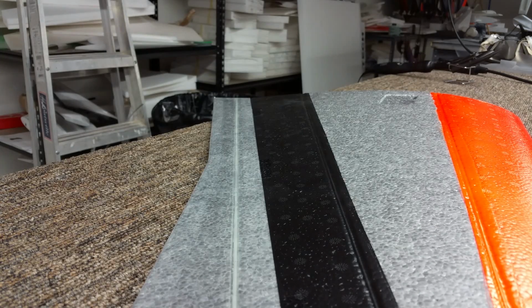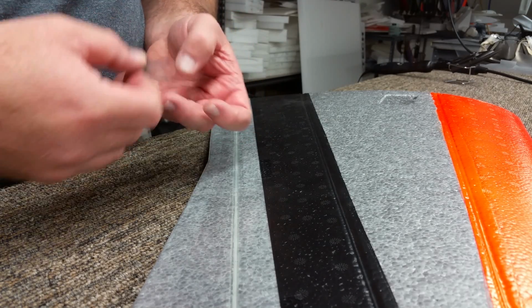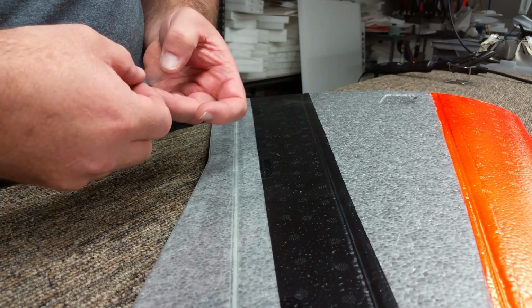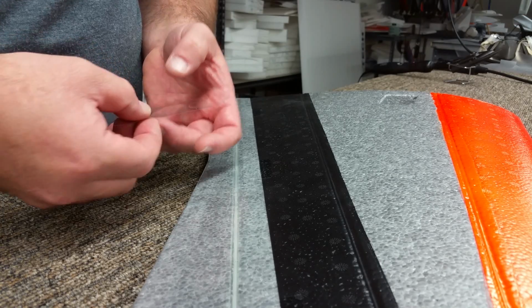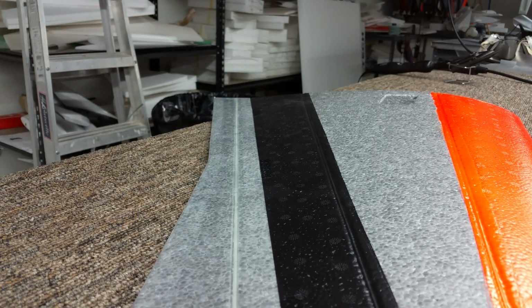So it might take a little bit longer, but when the airplane's Elevon pulls, what's nice is it pulls to where it's hinged on top of the control surface and then underneath the wing, and then the opposite on the other side. So when it actually pulls, it pulls nice and tight, and it pulls to that sharpest edge of the trailing edge of the foam.